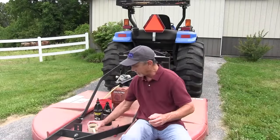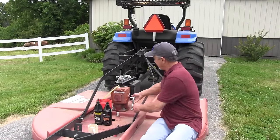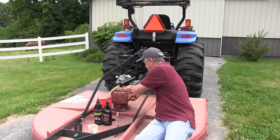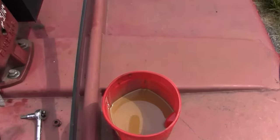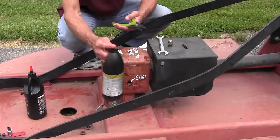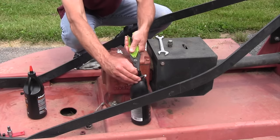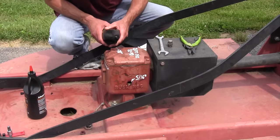That's the bulk of it. Next thing I'm going to do is take the plug out of the side, and then it's time to dump the new oil in. I'll show you what I got out of there — it looks a little bit like baby vomit. One other tool I forgot to mention: a pair of tin snips to cut the top off of the new oil. Make sure that doesn't go in the gearbox, and here we go — we're going to fill it up until oil runs out right here.